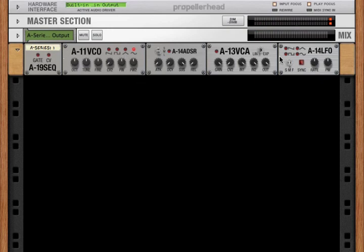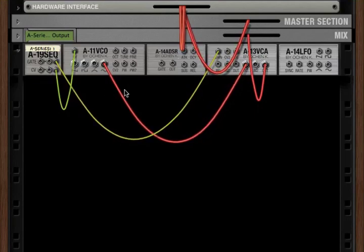It's just a single sine wave oscillator directly driving our VCA. When we directly drive, it means that we don't have any fade-ins or fade-outs. When we release a note, the note goes away. If we'd like that to fade out, then we need to drive our envelope generator, which then drives our VCA.